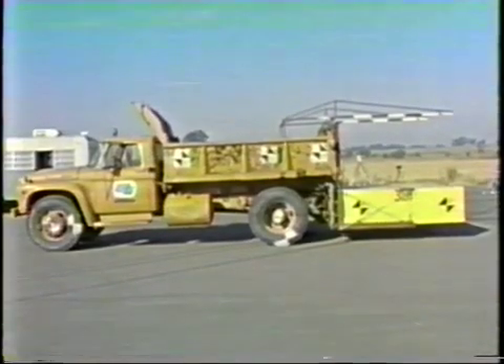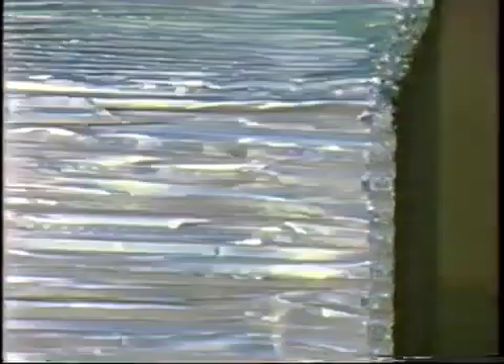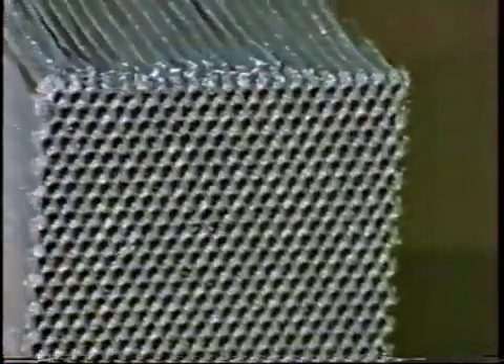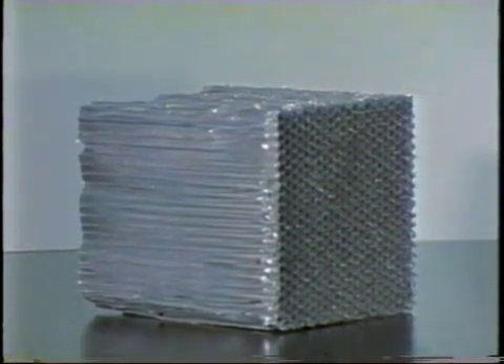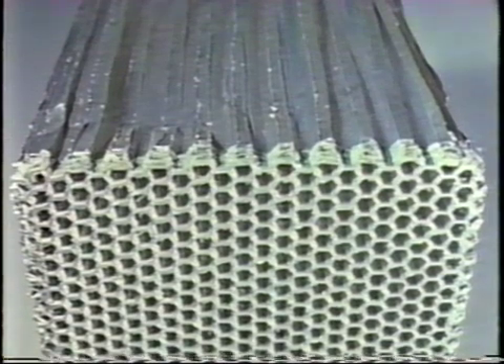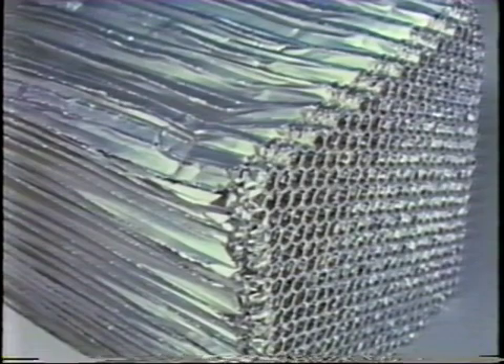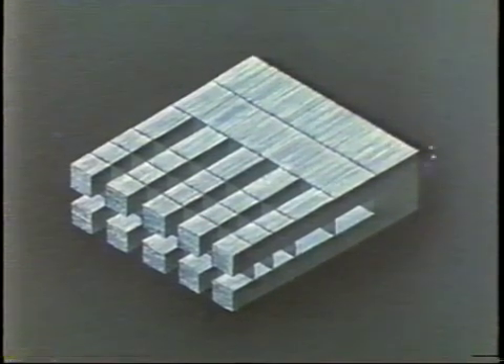Since the purpose of the attenuators is to soften impact, the construction of the attenuator is of primary importance. The sole energy-absorbing material used in this truck-mounted attenuator is Hexcel aluminum honeycomb. It is a low-cost, lightweight material that can withstand moisture, is easy to work with, and most importantly will collapse to a small volume when impacted. The size of the honeycomb openings is three-eighths of an inch, and the aluminum thickness is seven ten-thousandths of an inch. All honeycomb sections were pre-crushed from nine and three-quarter inches to nine and a quarter inches to remove the compressive peak, so the material will have a constant stress level from the instant the attenuator is hit.